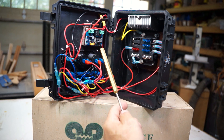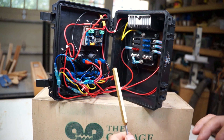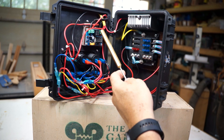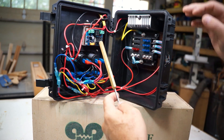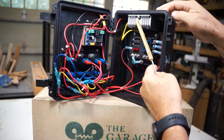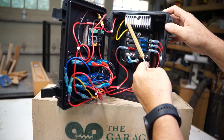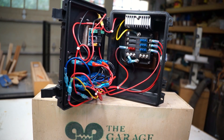To test it, I'm going to put in a tool battery, run it down until it stops working, and test the voltage there — that will determine where the battery stops voltage-wise, and then I'll reset it. So when the battery voltage gets drawn down below 16.2 volts, it will cut the whole entire system off. From here, this takes the 18 or 20 volts from the tool battery through a relay, then up to a buck converter. The purpose of the buck converter is to convert 18 or 20 volts down to 12 volts, because this system is set for 12 volts so we can use light fixtures from RVs, campers, and things that work on a 12-volt system.